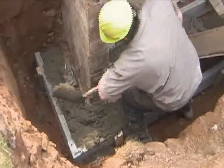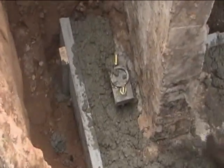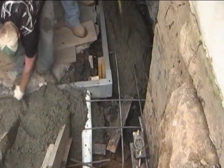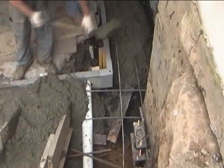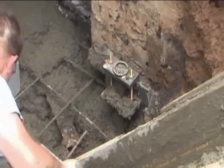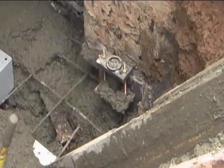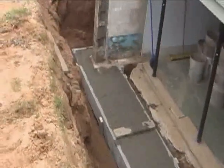The original footing didn't have any rebar in it, which allowed it to, when it cracked, to just settle right down and not bind together. Rebar helps strengthen the concrete in case it does crack. When the footing is poured and cast around the steel and the piers, it doesn't necessarily need the soil underneath anymore to support the home — the house can be supported by the piers encased beneath the footing. The concrete is put in around the pier brackets, encasing all the steel, providing a firm footing for the new wall.